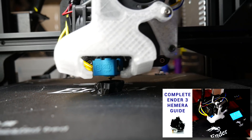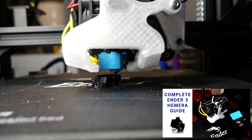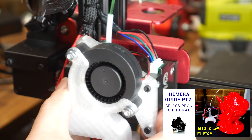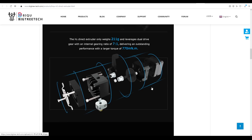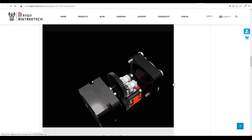I've made two videos on this before: the first fitting it to an Ender 3, where it felt a little bit large for my taste, and the second rehoming it on a CR10 Max, where it's been performing very well ever since. The big selling point is how compact and lightweight it is, particularly compared to the Hemera. To achieve this, the stepper motor is actually smaller than the NEMA 17 primarily used in 3D printers, and it uses an internal gearing system of 7 to 1 to give the small stepper motor enough torque for the job.